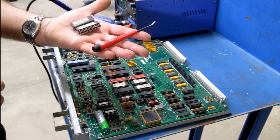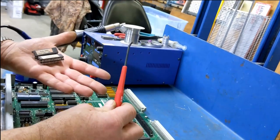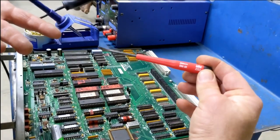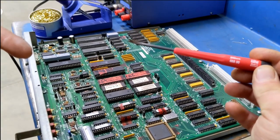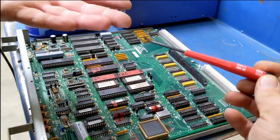So now the next step — we're going to do the RAM clear. This is a chip lifter. It's a really handy tool. This is the one that I happen to use. They're pretty inexpensive — I bought this one on the internet, I think it was like seven bucks. One of the better seven dollars I've spent. You're also going to need a set of clear chips, and I have mine mounted in a socket.